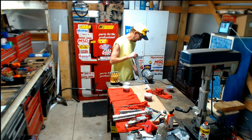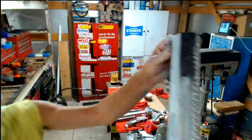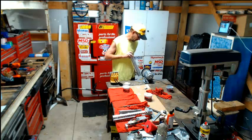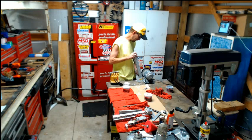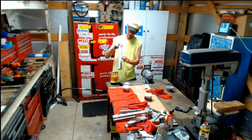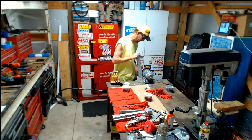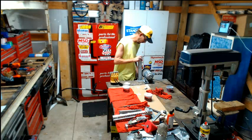It will turn black. I'll show you what that is like after you do a couple little sections. It will turn black. It's digging through the material, but it's just part of it. I mean, it's a wheel. You can touch it. It's not going to hurt. It's a 100% cotton wheel. See, after I preloaded it, I'm working my way up it, and it's getting new material, new polish with it as I buff it. That way you're not constantly loading it up. It's gonna be so beautiful.